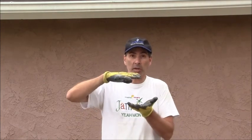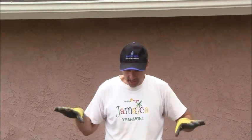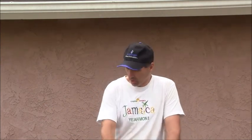The reason why is because if you don't do proper preparation prior to putting the concrete and you don't give a good compaction, and then you pour your concrete and then a few weeks go by or months go by and you get a good rain, then that soil underneath your concrete compacts on its own due to the weight of the concrete, plus you had a rain, so it kind of maybe swelled up and then shrunk down, and then when it shrunk down it compacted. If it just drops an extra quarter inch, half inch, or whatever, it could potentially crack your concrete. This is how you get settling cracks, and this is how you prevent settling cracks.